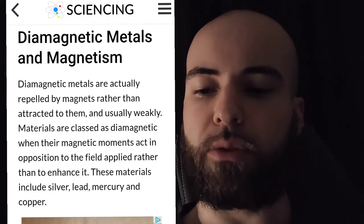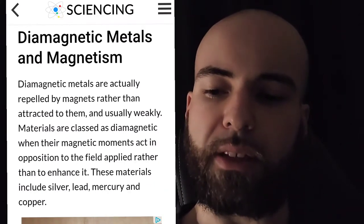Gold and silver are diamagnetic — the exact opposite. They repel from magnetic fields. This can be measured with strong magnets and precise scales — magnet scales. You will always see repelling or attraction. If there is no reaction, part of the gold bar is tungsten, since the differences balance out each other. I have read that 30% tungsten in a pure gold bar would create this balancing effect and the bar would have no reaction.